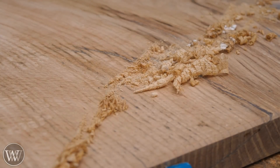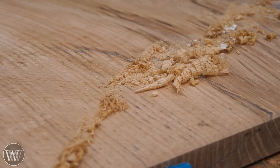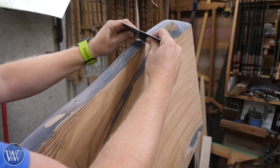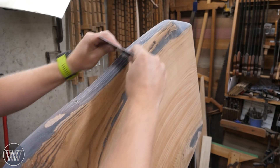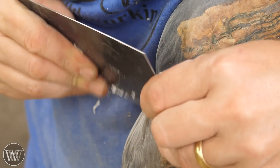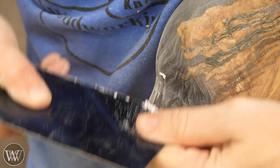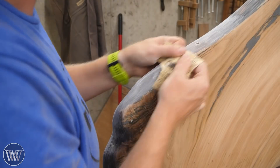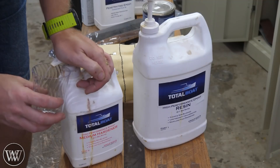A little closer you'll see — oh, that was sawdust with only a little bit of curl, which means I probably need to sharpen it a little bit. Sharpen it, come back — ah, that one's better. This also works very well on the epoxy and getting it to its final shape. It doesn't actually smooth out the epoxy — for that we need to polish and sand it — but for most of it we can get it down to the shape we want. Then I'll come in with 400 grit, 800 grit, 1000, 2000, 3000, and then into polishing.